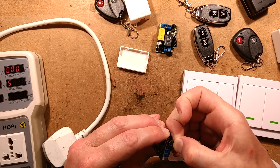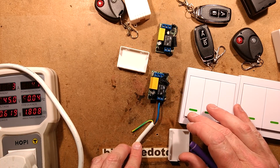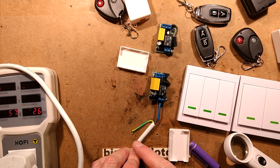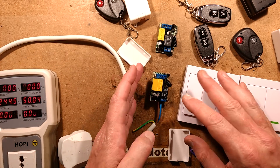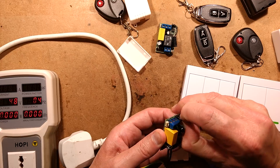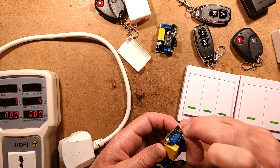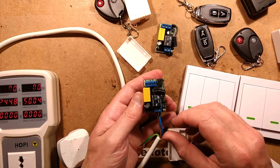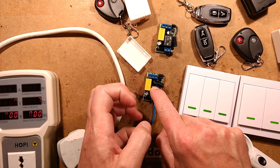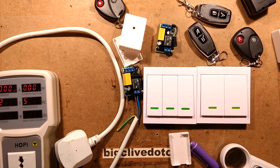So I've swapped that across - let's plug it in again. And this time it should be momentary action. Yep, there's a slight lag, but it'll only hold the relay on as long as the button's held in, which is not so useful for use as a light switch but makes it quite useful for other things like a remote operator or a button. So yes, interesting little devices - great for hobby and fun use, but perhaps not suitable for professional use or installing somewhere that could set your house on fire, particularly with the rating of that relay. Unlike many of the more UK-compliant ones that usually have a thermal fuse in the relay to kill the power if something goes wrong, this one doesn't have that. But very nice - a cheap way just to have remote control stuff.